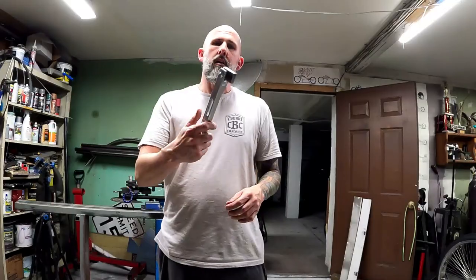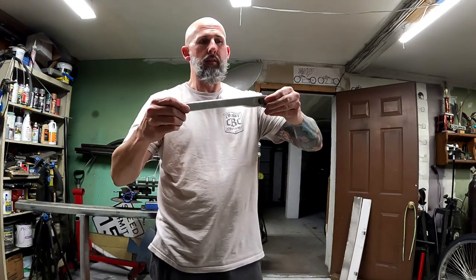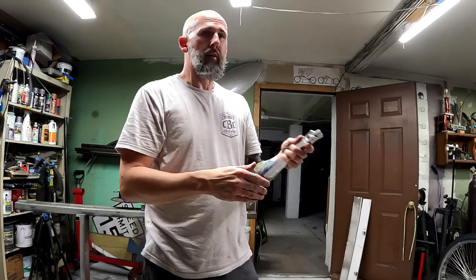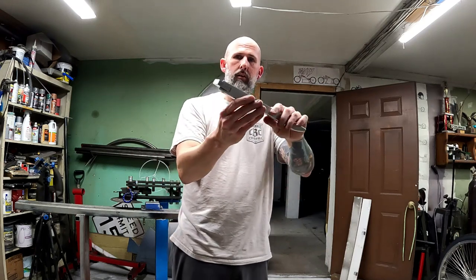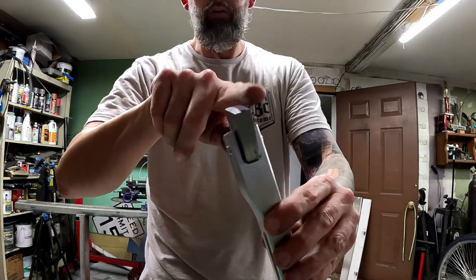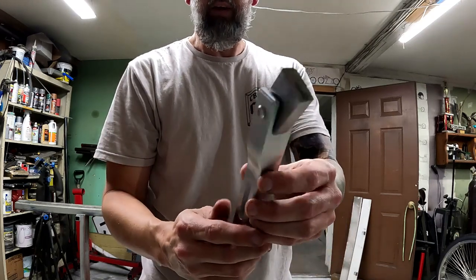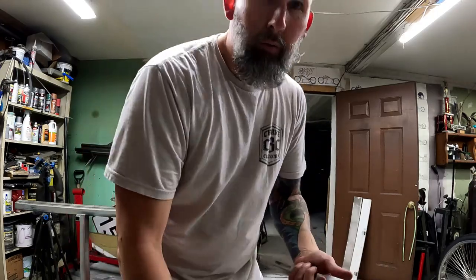All right, super easy — it's a nice kickstand. I need to put it where I want it, mark it on the frame where I'm gonna allow it to lay. I want it to sit right here, also gotta watch and make sure it's not hanging too low on the bottom. I'm gonna have to take this part here and grind it into a point because it's so thick that my welder is not going to weld that. So I'm going to go do that real quick and then we'll throw it on.